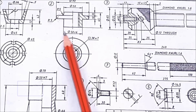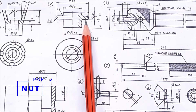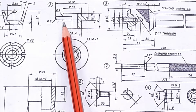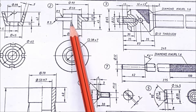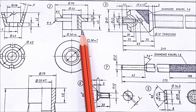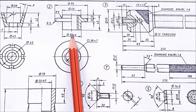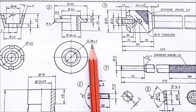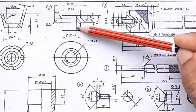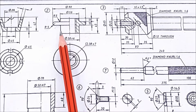Part number 2, that is nut. Half of the nut will go inside the body and half will be above the body. The total length is 45 mm, so 45 minus 20 equals 25 mm — 25 mm of the nut will be inside the body. From this point, mark a length of 25 mm on the axis line, then draw 2 points at the edge of the body at 50 mm, and mark 2 more points at a distance of 19 mm since the internal length is 38 mm. Mark 19 mm and 19 mm, then draw this line of 45 mm and join these lines. Repeat the same step on the left side.